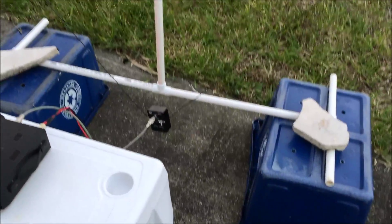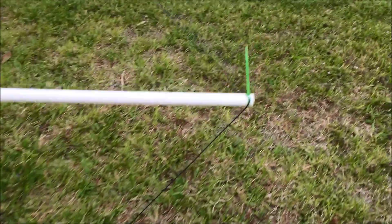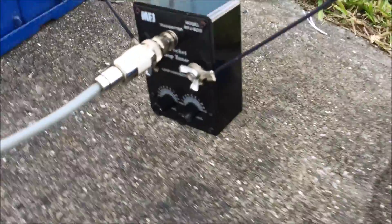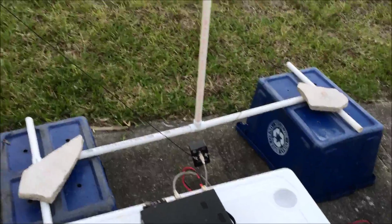So this is what I have here. You've probably seen my loop tuner on Winter Field Day last weekend. I'm using the same PVC stand I made here with 13 feet of wire — the included wire that comes with it, cut down to 13 foot, with the little ring terminal crimped on the end. 13 foot for 20 meters, with recycling bins and rocks holding it up because it's a very windy day. Running on just a 12-volt 7-amp-hour battery with a little jumper coax — and that's it.